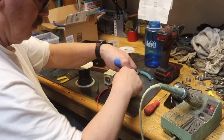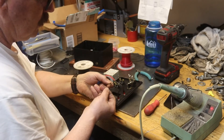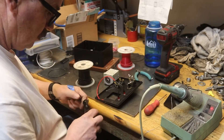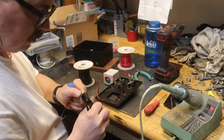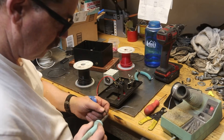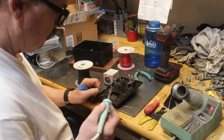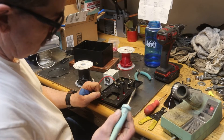I'm hooking up a couple of the lights. I've got a common because they're both AC lights, so that'll go to the neutral. Then this will go to the outputs of one side of each switch. I need to put some extensions on them because they're not quite long enough to reach. I'm using 20-gauge wire — nothing is high-powered in here, it's all low amperage. I tin the end first and then just melt them together.